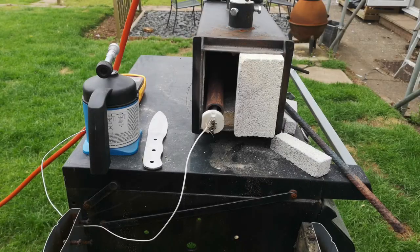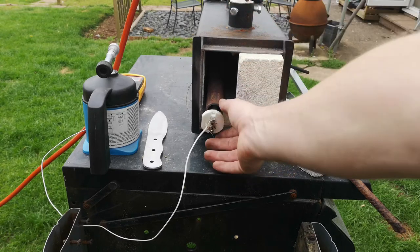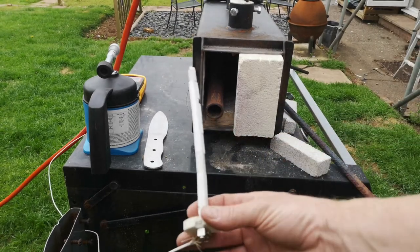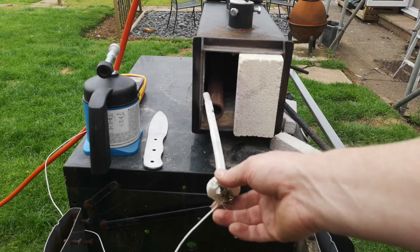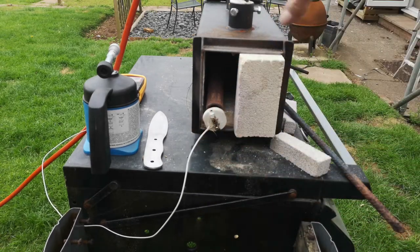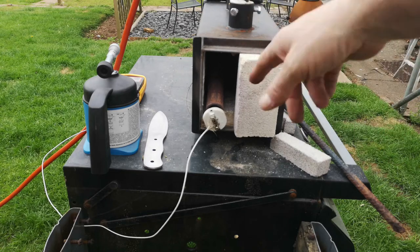Here's how I've got it set up — I block off as much of the forge as I can to keep the heat in. This is my thermocouple, bought off eBay, which has ceramic surrounding it making it more resistant to higher temperatures. I've also got a metal tube around it. The reason for that is if I just put the thermocouple in there and turned on the torch, it would read a much higher temperature because it's within the flame — it wouldn't be an accurate reading of the forge temperature.